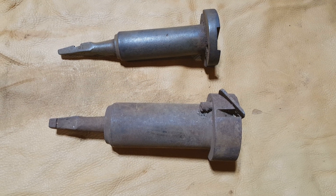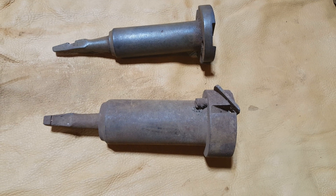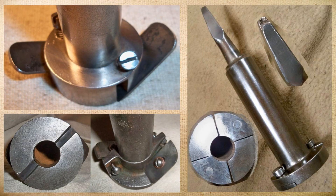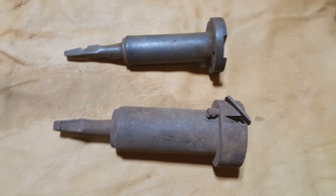Next up we have the fixed cut hollow augers. These are made in sizes from a quarter of an inch all the way up to one inch, and there are several different styles you'll encounter. The one in the upper right corner has a screw that comes down at an angle to lock the blade through the top of the body. The second one was made by the James Swan Company — there the screw goes through the blade into the body, and there's also a second screw on the side for adjusting the angle of the blade a little bit. The last one, made by PS&W and a number of companies, has the screw going from the top right down into the blade.